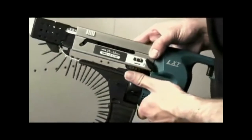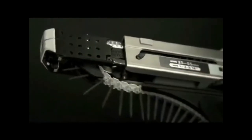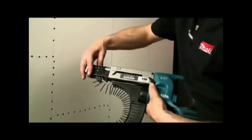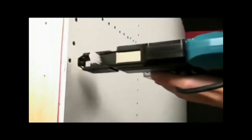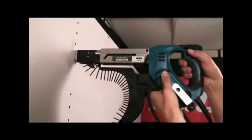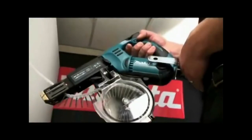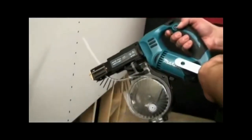To increase durability and operational efficiency, Makita auto-feed screwdrivers feature a silent clutch that offers smooth engagement of the drive assembly. The driver bit and clutch are synchronized to ensure the engagement occurs at the optimum position. This reduces operational noise and increases durability of the tool by reducing wear and tear on the clutch. The silent clutch also offers a direct drive transmission, providing the same amount of driving power in either forward or reverse gears. The screw guide keeps the collated strip in the proper position for driving and collapses easily to eliminate damage during storage or transit.